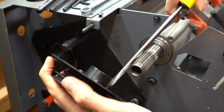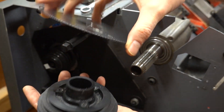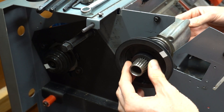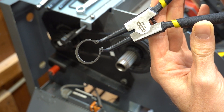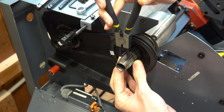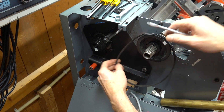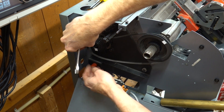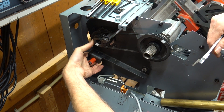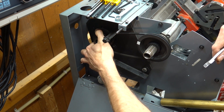For the new controller I will not be needing the optical encoder wheel, so I removed this before mounting the pulley back onto the spindle. Lastly, a retaining ring to make sure everything stays in place. The pulleys provide the option of choosing between three different belt ratios. Since I'm planning on making small parts initially, I have selected the option that will give me the highest spindle speed, which of course will come at the cost of less torque.